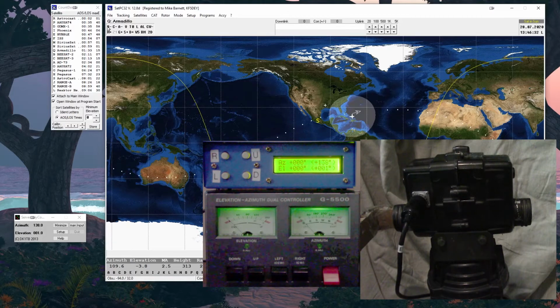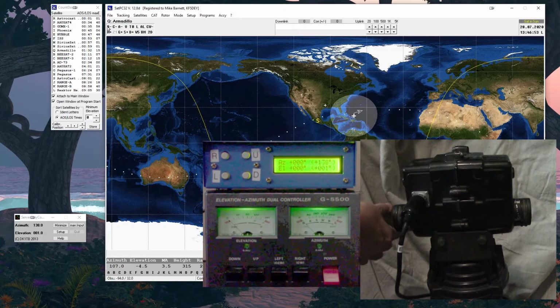we make sure we're full left, so we have to be powered on and no antenna attached for obvious reasons. Pointed north, make sure it's rotated full down and full left, and now we have a starting point. And we have to do this with the antennas off for obvious reasons. One is it's kind of a pain to move around the antennas, but the second part is if I had this rotor, if I had the antenna mounted backwards, right? We forgot, and we've seen this happen.